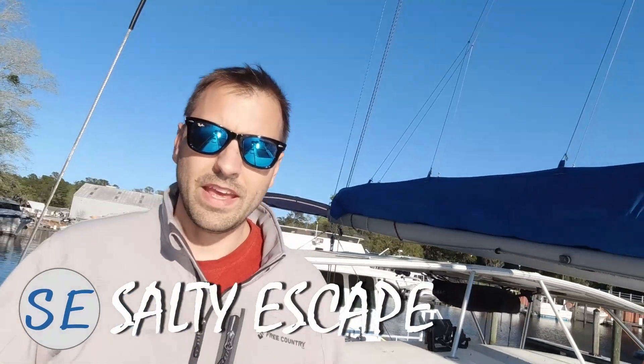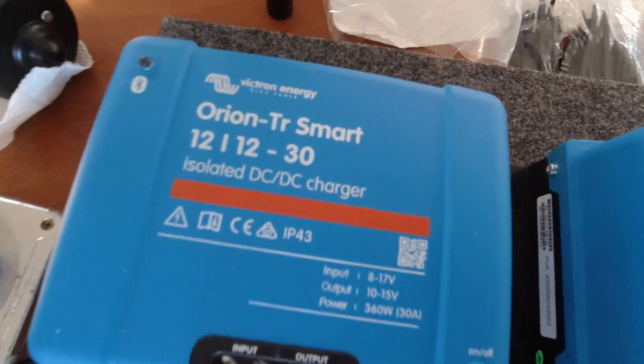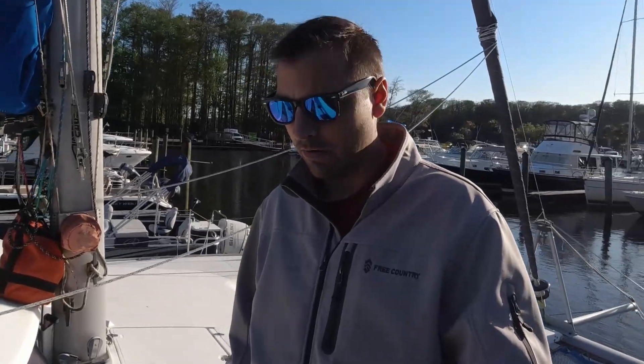Work continues on our battery modification. If you missed our last two videos, we built DIY battery boxes and installed our DIY battery bank to 1,400 amp hours. The previous batteries were lead acid wet cell batteries and the starter batteries were also lead acid. You can't blend lead acid and lithium iron together easily - we're going to do that with the Victron Orion DC-to-DC charger. In this video we're completing our battery installation, moving the starting batteries to the engine compartments, and setting everything up with the Victron Orion DC-to-DC 30 amp isolated smart charger.